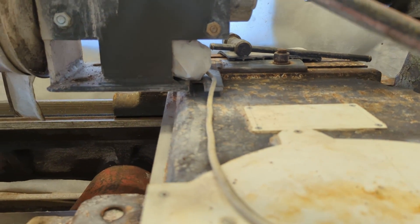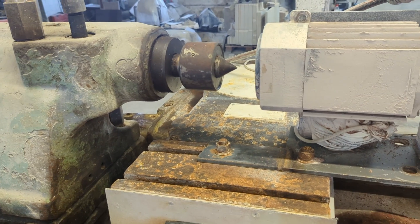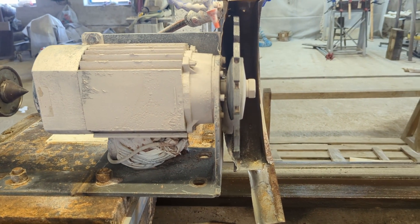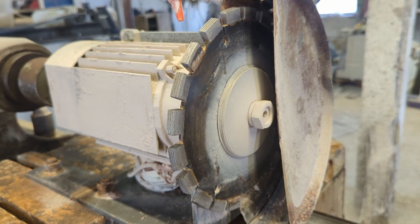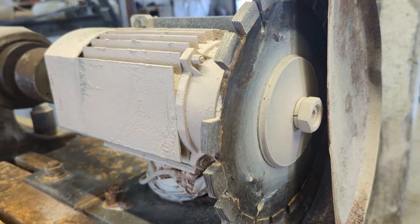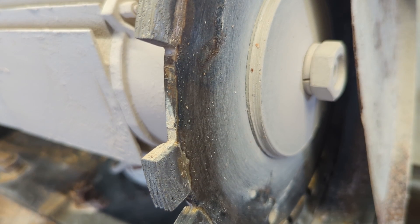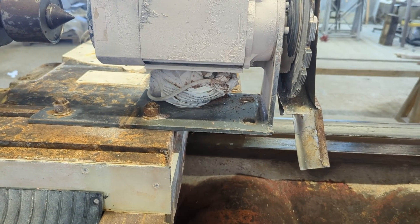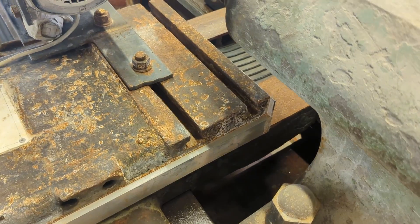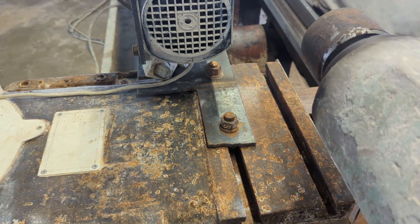All changes connected with the Y and Z axis are temporary, caused only by the need to put the machine into service as soon as possible. The first thing I need to change is the saw blade drive and its mount. Also to find reliable segments for side cutting, since these are only good for straight cuts. That's why in the video I first cut the grooves and then proceed with the finishing pass sideways. The main problem with this setup is stiffness — I have a very large tool deflection even after two spring passes. There is no need to try to process a workpiece with a diameter of 650 mm, but I want to use the machine to the maximum. So the saw assembly is the first in line to rebuild.